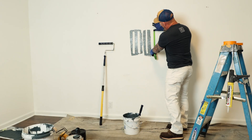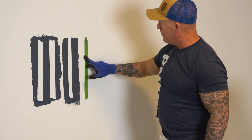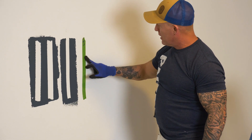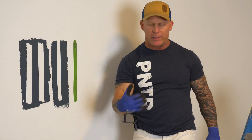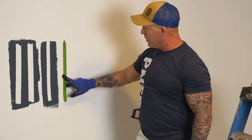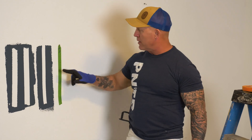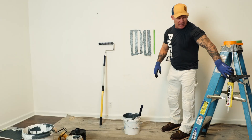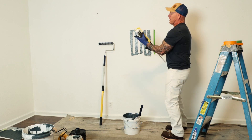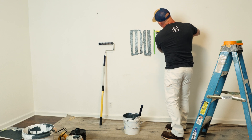Now I'm going to put some Frog Tape green on the wall and we'll just caulk our Frog Tape green and see the results. There's a little bit of bleeding — this is a really rough wall, so I wouldn't expect Frog Tape green to 100% seal that. I gotta say that's pretty amazing on a rough wall like this. But now I take Frog Tape green and then I just take a little bit of clear caulking and put a little bit of clear caulking on here.